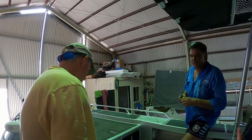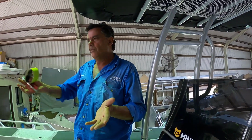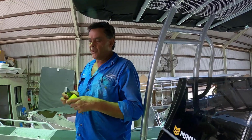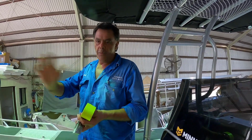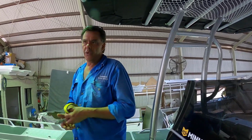Really. And the good thing about the Penetrol, if you have any scuff marks on it, which you're going to have, mooring at ramps or what have you, it's really easy to touch up. It's just a quick wipe with an alcohol product to clean it up, and then wipe another coat of Penetrol on it.